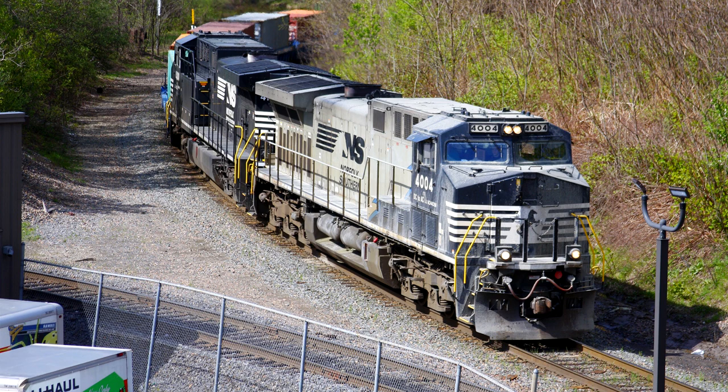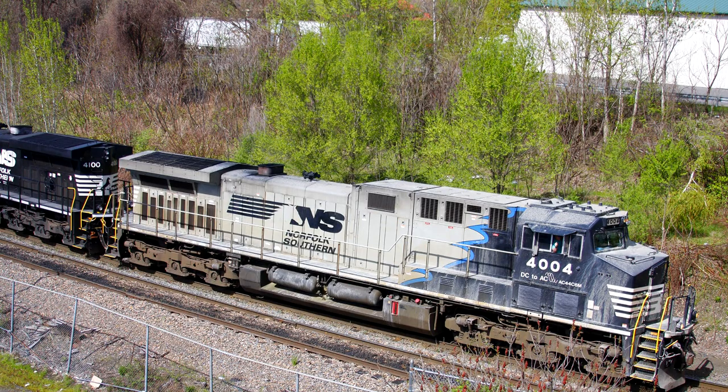I've heard that the Santa Fe 600 series locomotives have mechanical fuel injection, whereas all C44-9Ws built for the BNSF have electronic fuel injection. If that's true, then their rebuilt AC44C4Ms would probably have electronic fuel injection too. Typically, the locomotive that leaves the factory and the same locomotive that gets removed from the roster at the end of its service life will be different due to revisions, redesigns, and updates of the replacement parts. Due to the new regulations of the 21st century, those particular prime movers are pretty much frozen in their Tier 0 state. If I recall correctly, the second oldest C44-9Ws on the BNSF's roster are the 960 to 1123 series,